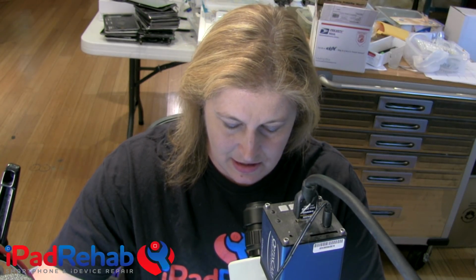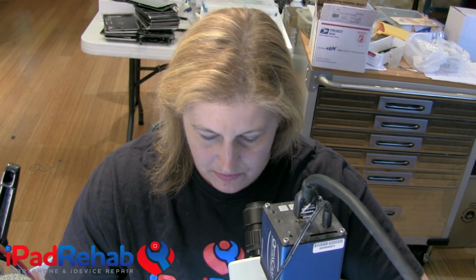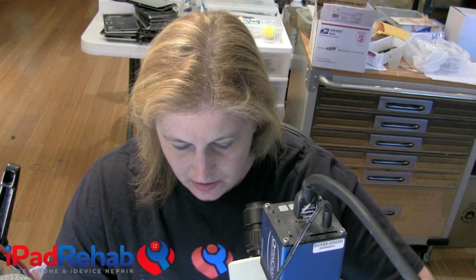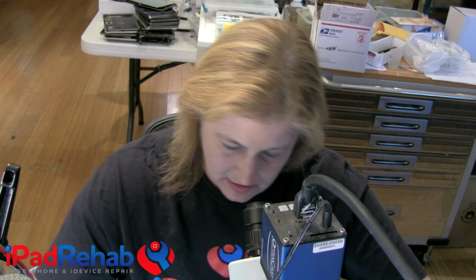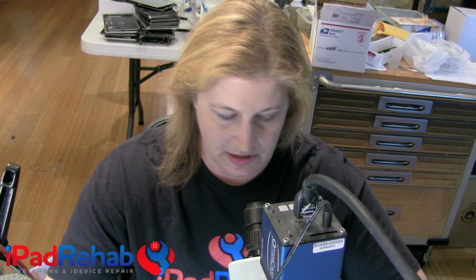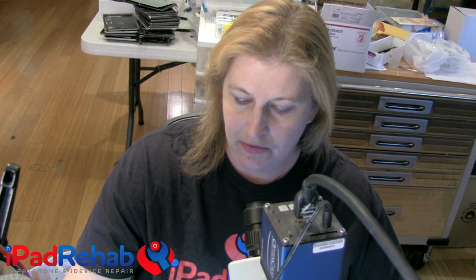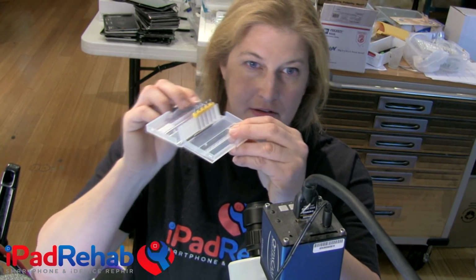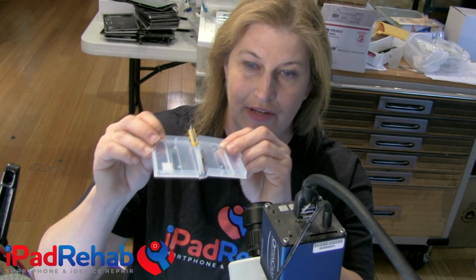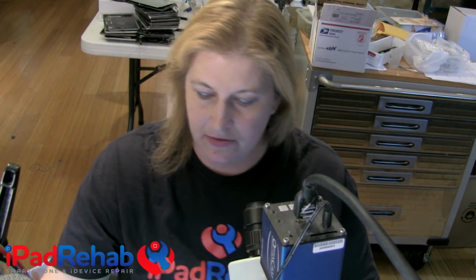So let's get this board back out of this phone. Bear with me for a minute. Tools you're going to need are whatever it takes to get the board out of the device, plus you're going to need a Dremel tool, and you're going to need some really, really fine Dremel tool bits like this. These are dental thinness. There's also some kind of micro thinness that we get, these sort of Dremel tool bits here as well.